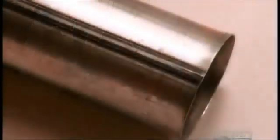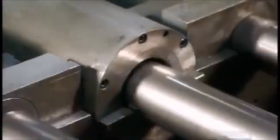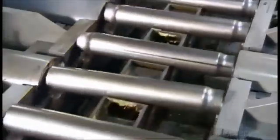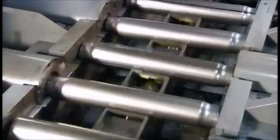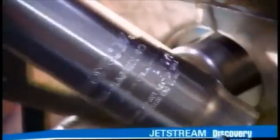The tube-making process is the same for the reserve and pressure tubes, except that the reserve tubes undergo one extra step: compressing the ends. This enables the shock to house a larger reserve tube that can hold more oil. The reserve tube's final stop is a press, where a die inside stamps the part number, the manufacturing date, and the brand name.